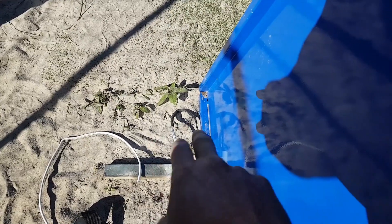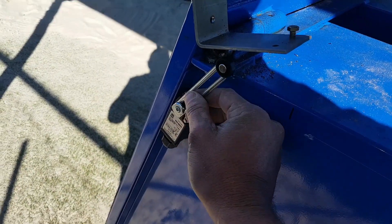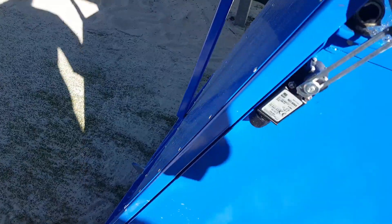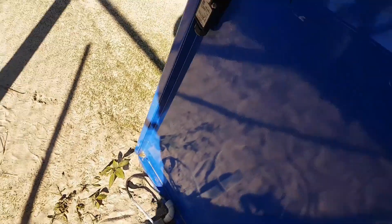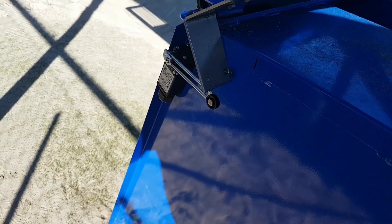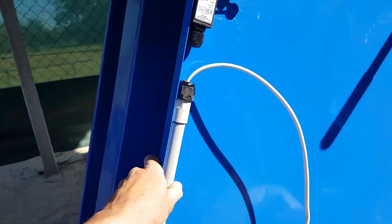I've got to put some inline connectors and heat shrink — just need to extend that cabling because we're upgrading this system. Looks like a bit of saddles and some conduit. Trying to adjust this limit switch — I think I might just have to bend it. You want it to trigger as soon as the door hits down there. So I might just need to bend that back — that's how the action works.